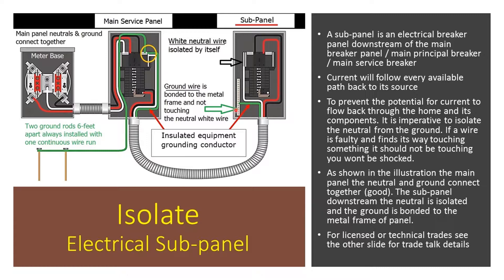This is where we want to isolate the panel. Many times, electrical panels will have a bus bar that ties the neutrals and the grounds together. This bar would have to be removed. All the neutrals would be installed on the neutral side, and it would be off the panel, not touching any metal, usually with plastic bushings. The terminal bar that's installed — most of the time the manufacturer does not provide it, so the electrician is going to have to provide it. This will be mounted to the metal frame. It's important to separate and isolate the neutral from the grounds at the subpanel only.